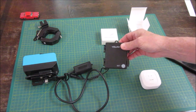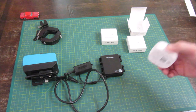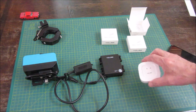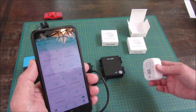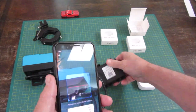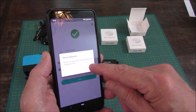Now I'm going to pair the Bulldog control module to the hub and pair the leak sensor to the hub, then set up automation so that when there's a leak it shuts off the water. To add a device, you just scan it — click on the top right and scan. Turn the device over, it'll scan it. It's that simple, it's added it. Say yes, you want to bind the device. Done.